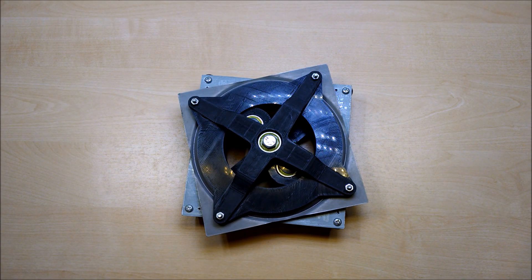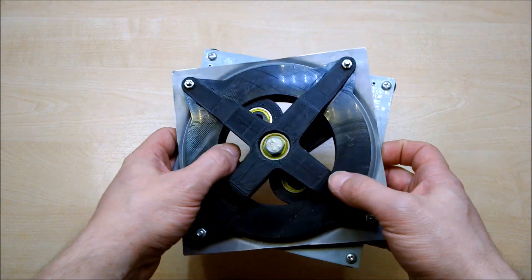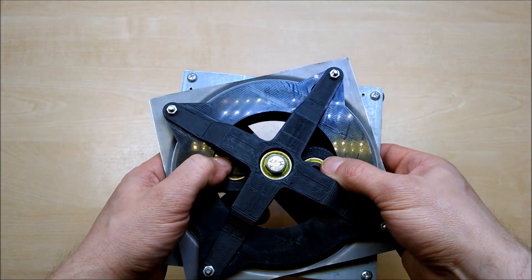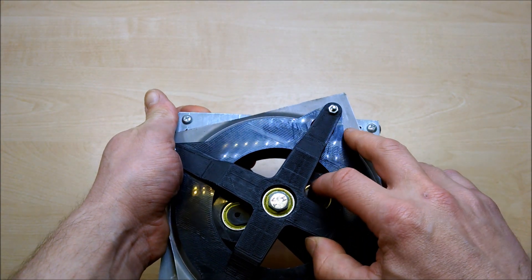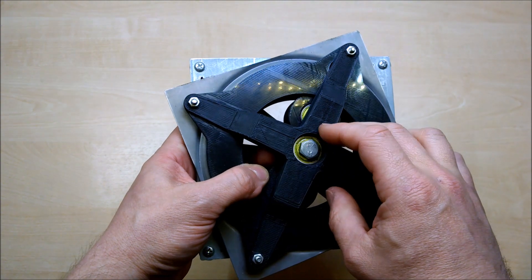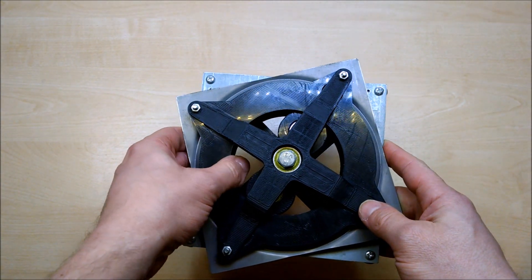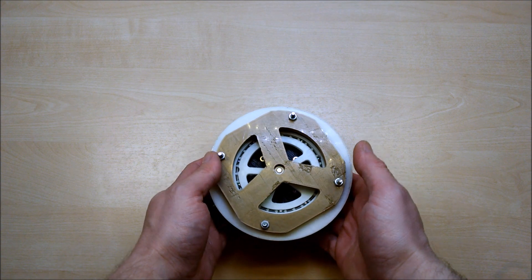This was the last design on the strain wave gear with timing belts that I worked on. It's a Lazy Susan bearing - you can see the balls there - and some 3D printed parts with skateboard bearings forming the centre axle of the wave generator arm, which had two nodes on it with skateboard bearings and rollers. With the HTD5M belt inside, it was quite easy to generate a skip on the belt - snap. Relative to the theoretical torque multiplication we should have got, we weren't seeing it because it was all graunching up and getting stuck. So I went back to the drawing board and decided to try something more stable in terms of support for the strain wave generator, and this is what I ended up with.